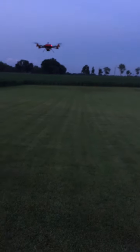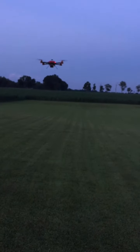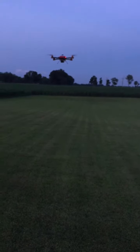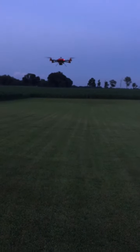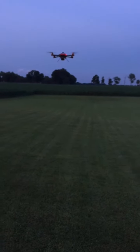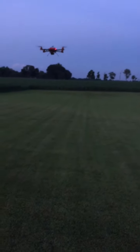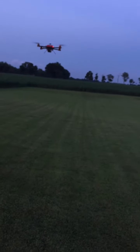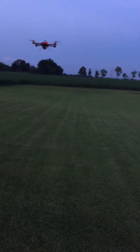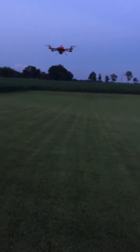And then I'm also doing some endurance time. These are the telemetry data. It tells me how much current is drawing, how much voltage I have, the flight time, what my GPS HDOP is, how many satellites I'm seeing, and the position of my battery. I can change any of those to whatever parameters I want. It lets me know that it's super leveled. As you can see, the level is 100% straight, 3D fix.